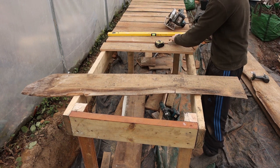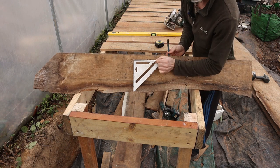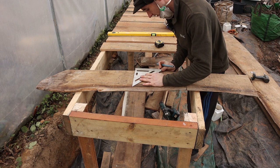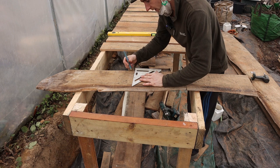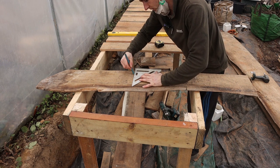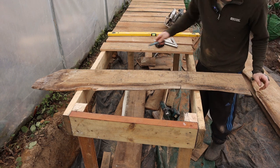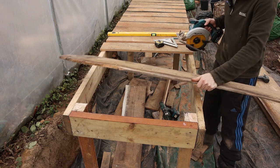And then what I will do now is I can put my set square on here parallel to that line we just drew. So matching that on there as good as we can, and then with the end of it in line with our mark for the 79, and then I can draw another line across there. Okay, and now I'll just cut out these two lines we did first. Let's cut that one off there.